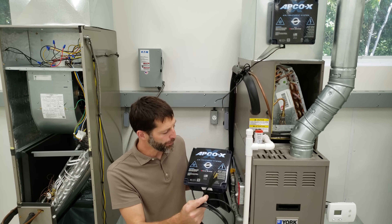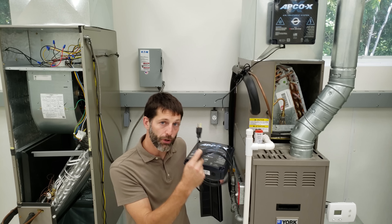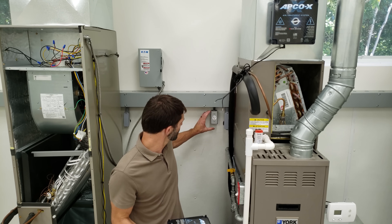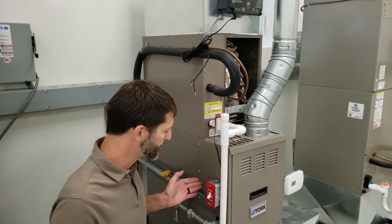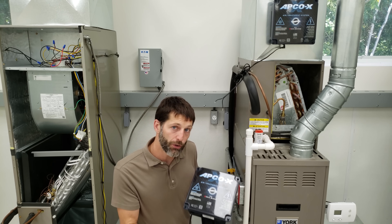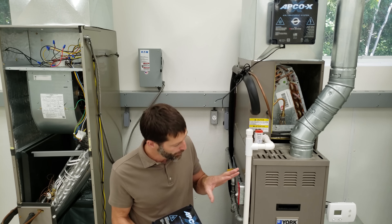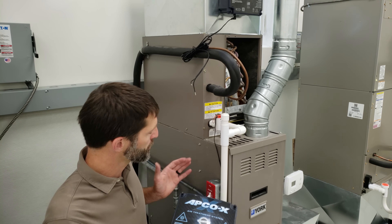In reference to the power supply, there are two different models to choose from, so you want to order the right one ahead of time. One comes with a pre-molded 120-volt plug and accepts anywhere from 110 to 277 volts. You can plug this into a separate electrical circuit near the furnace or the same circuit as the furnace, with power going into the receptacle and then from the receptacle to the switch. Remember that this unit is going to be on all the time — it does not turn on and off with the airflow. The switch for your gas furnace will just turn off power to the furnace itself. Refer to local electrical codes and your electrician regarding this.